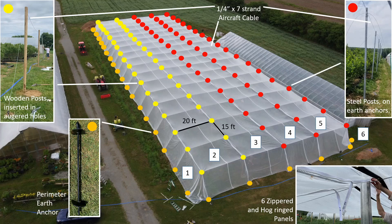In talking with both of those companies more recently, they can now do up to 36-foot spans. Partly as a result of the work we've done, the companies are more ready to support a 36-foot span. In more recent installations, the grid is getting larger — up to 20 feet in the length direction and 36 in the width. So that reduces the hardware quite a bit and also makes the netting management a lot easier. You're dealing with fewer zippered seams, which are all along these cables. So both first-time installation and seasonal retraction and deployment becomes a bit easier. Best to discuss your specific site and needs with the folks at GenTech Shade Technologies when laying out the system.